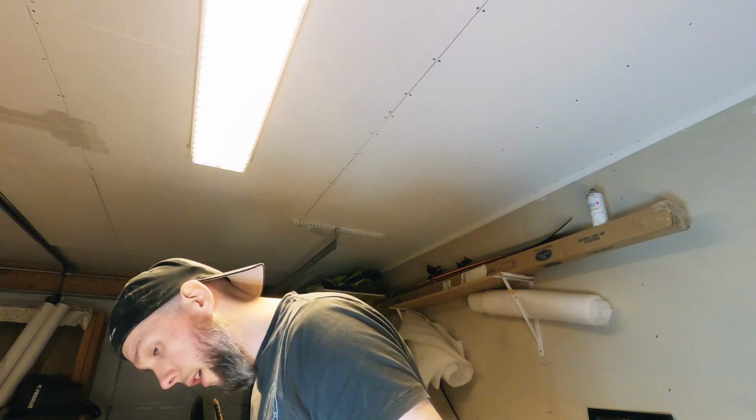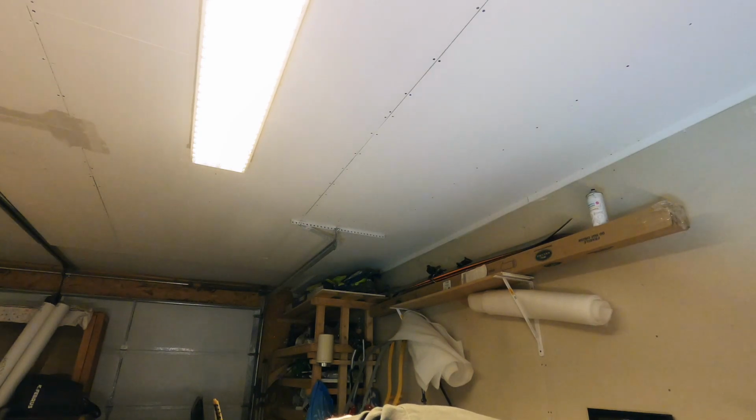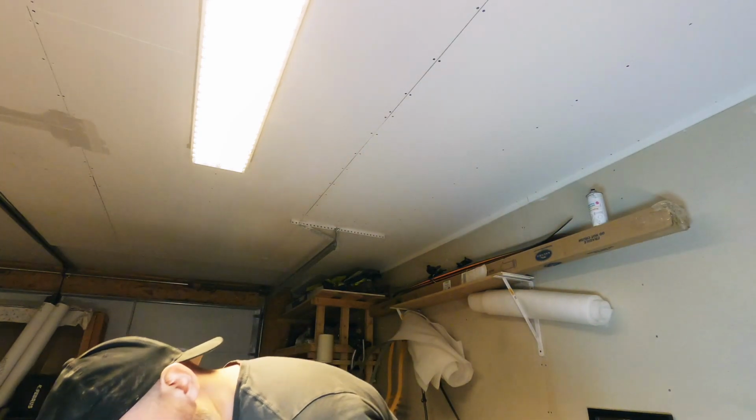So this was basically my epoxy step. It's going to harden. As I said, it can feel dry, but it isn't. It takes 24 hours at room temperature. It's going to dry for at least 24 hours. And then I'm going to wipe it down with a rag and warm water, because there's a film on it that won't allow finish to set on it. The finish will basically just peel off. So that's that. It's not rocket science. It's not hard work. It's not difficult. Leaves a great result.